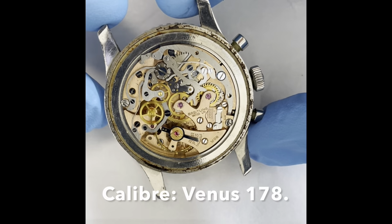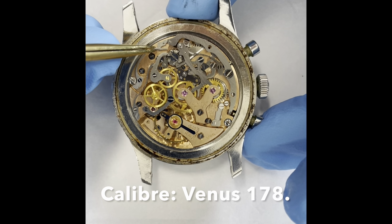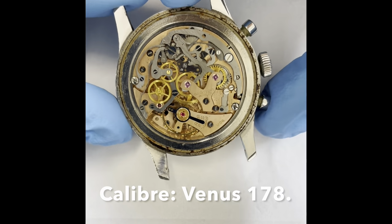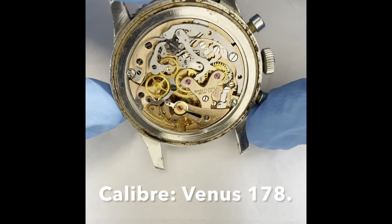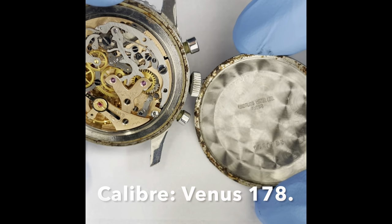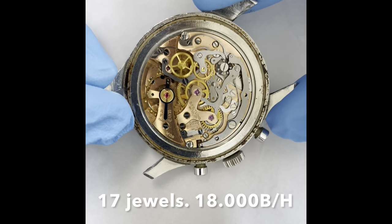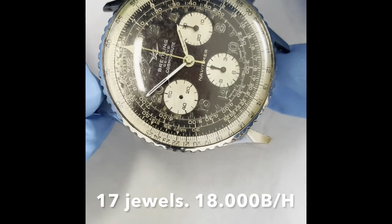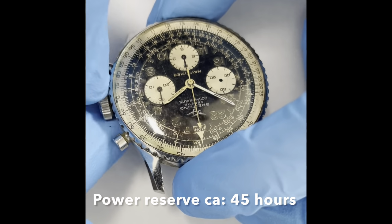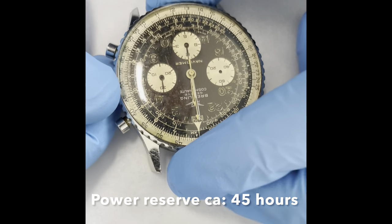That movement's actually in fantastic condition. The reason why it's not start stopping is because the spring has come disengaged with the start stop lever. Let's see if we can put that in place. So, start, stop, reset, good. I can send it back to the client now. No, not so fast. I think we need to clean it up. That's what we call dry humor. Anyway, that's a good start. I'm going to set the hands up so they're ready to be taken off the dial later.